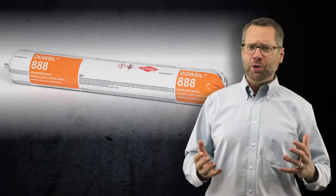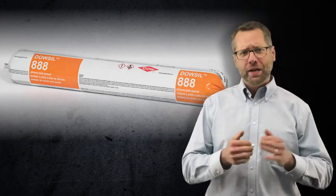In some remedial work, up to an additional ½ inch may be necessary. For joints that are 1 to 2 inches wide, the maximum bead thickness of the silicone sealant should be ½ inch. Joints are designed so the walls are generally perpendicular to the pavement surface and have a rectangular reservoir. Where field conditions prevent a strictly perpendicular angle, small spalls can be sealed. With a proper joint design, the field work is ready to begin.